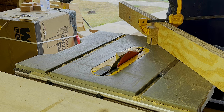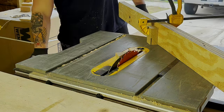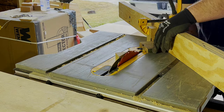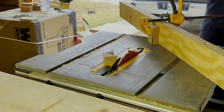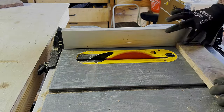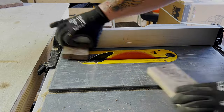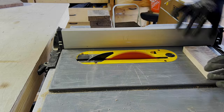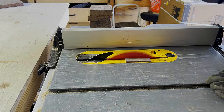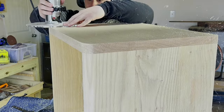While everything was glued up I went ahead and cut some test pieces for legs — a really simple design, just a three-and-a-quarter-inch square with a 30-degree bevel cut. I wanted my wife to choose between walnut and white oak, and she immediately gravitated towards the walnut. I cut out a bunch of three-and-a-quarter-inch squares; they were only an inch thick so I wanted the legs to be a little beefier. I cut out eight of them and glued them together to make four legs.